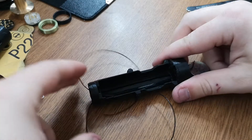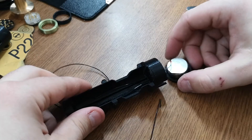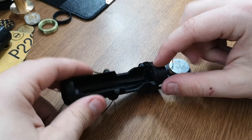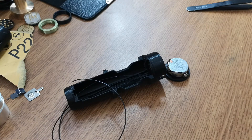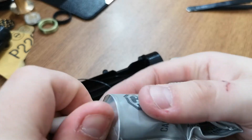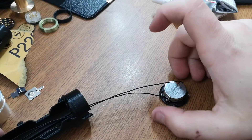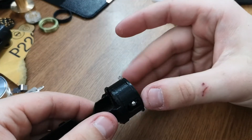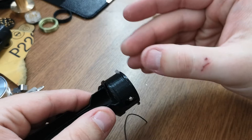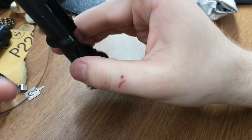Here I have the speaker wired, with the wires routed through the channel below the battery. We're going to apply a little bit of E6000 to the edges of the speaker, press it in place, and leave it to glue. The E6000 has a cure time of 72 hours but a set time of approximately 30 minutes, so after half an hour you'll be good to handle this — just don't be pressing on the speaker. We're going to leave the glue on the edges because once it's dried we'll be able to peel it off in one strip. Press it firmly and set it aside.